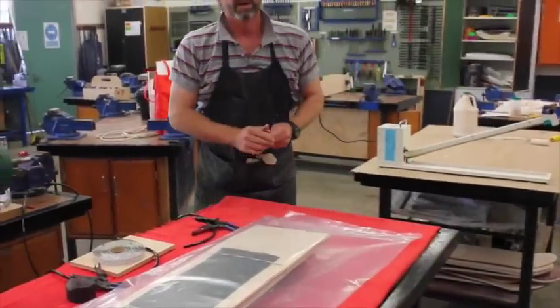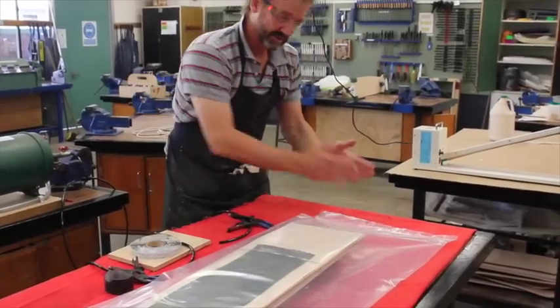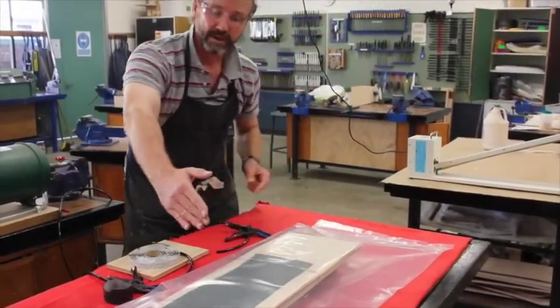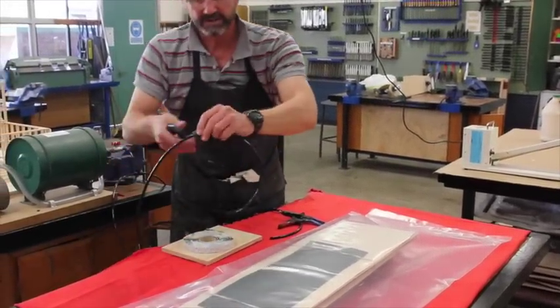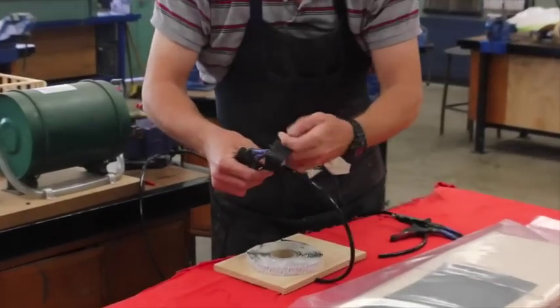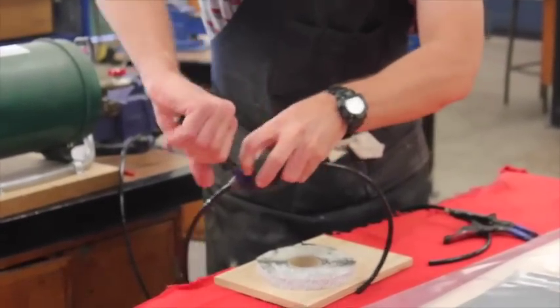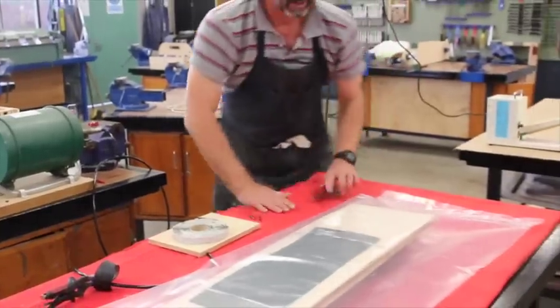So do you just recut that bag open? Right, we cut the bag open - get it a little bit shorter each time, leave the pipe in there. So we're only losing this much every time we want to make a skateboard deck. Now what I'm doing here is I'm just going to put a hole in this bit of plastic tube. I just clamp that off like that so there's no air coming out of this line - this line's ready to go.